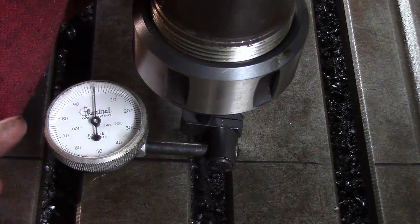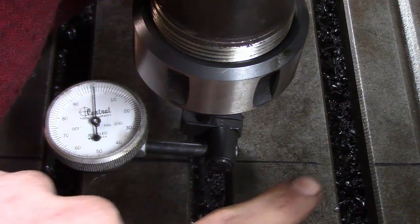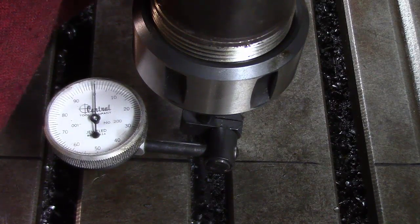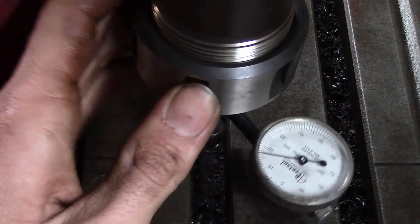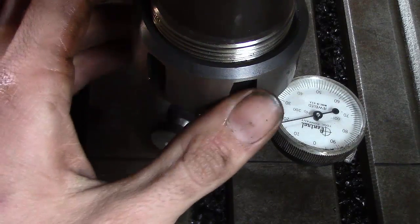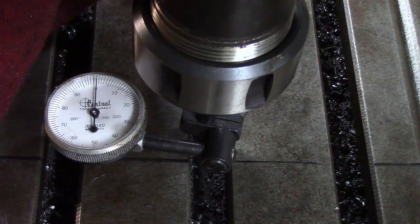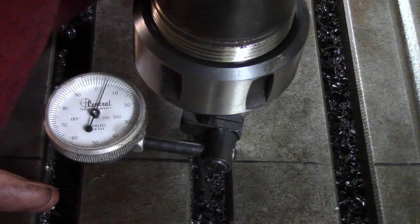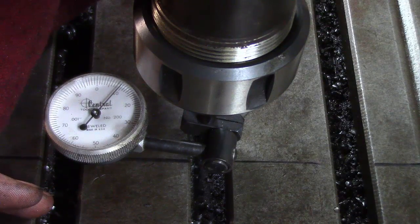We're set up to check the tilt. I've taken a magic marker and put a nice 90-degree line on my table so I've got the same measurement point every time. You go straight to that line. We're going to check how far we're out — go to the back of the line — looks like we're at about 17 thou. Zero over here and we'll try our luck to see which way we're going to go. There's 5 thou, let's go to 10.